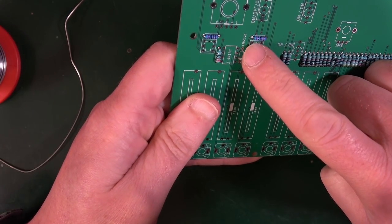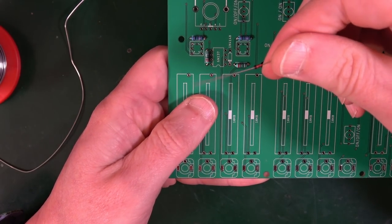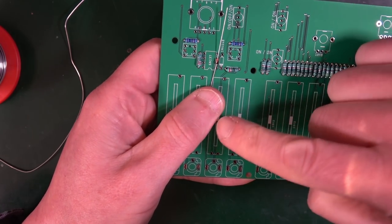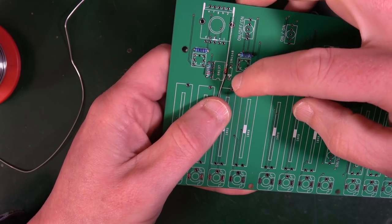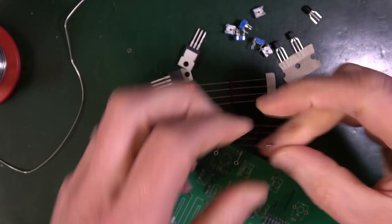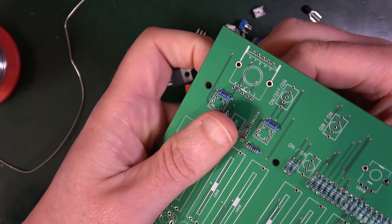Over here, 1N4148, over here. Now you'll see the line on the board, yeah? That needs to go with the black line on these particular diodes, because diodes only flow in one way, so that black line shows you the way it doesn't flow. It can't go in there, it's like a shut door. So stuff will flow that way. All that's important is that you get that line and that line the same way around. That's what you want, yeah? Like so. Whoops.